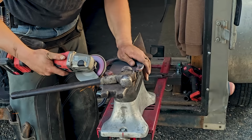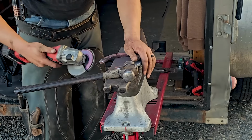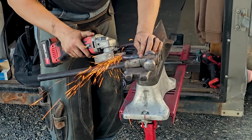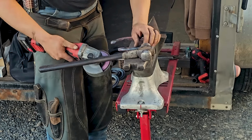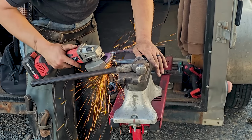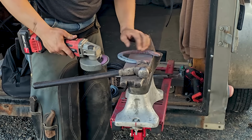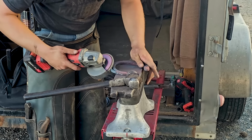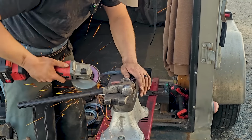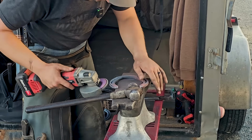So we're grinding on the foot surface of the shoe. This is the portion of the shoe that lays up against the hoof. And this is called boxing. We take off any sharp edges that he could catch with one of his other feet. And we grind almost right up to where our burn mark is from when we hot fit the shoe. This is called safing. This is done to the ground surface of the shoe, and we safe that medial inside heel so that he doesn't cut himself if he happens to step over on his other leg.